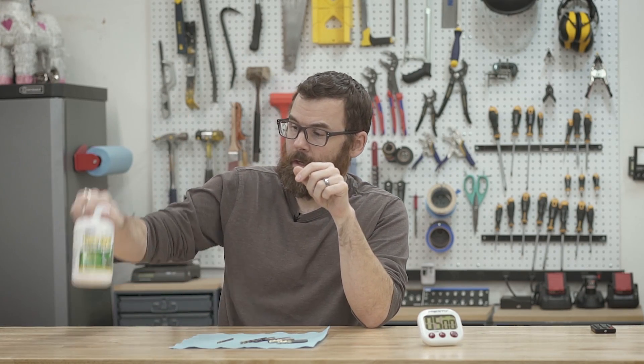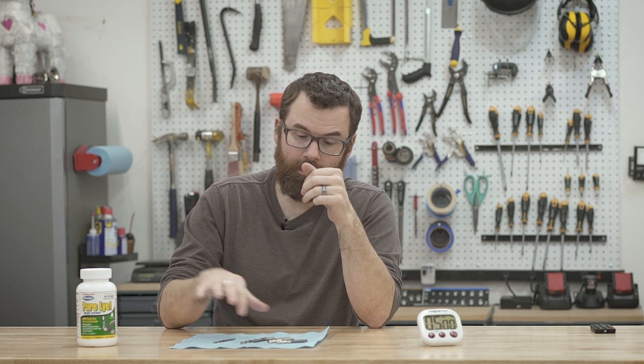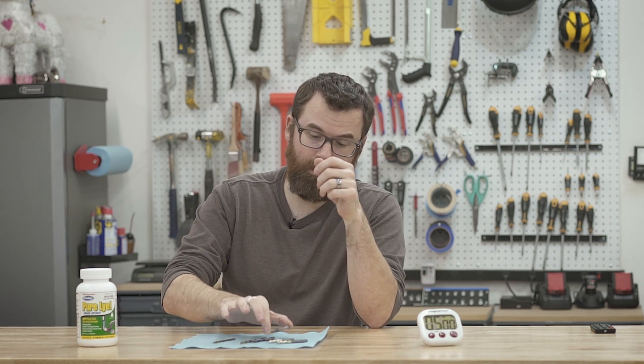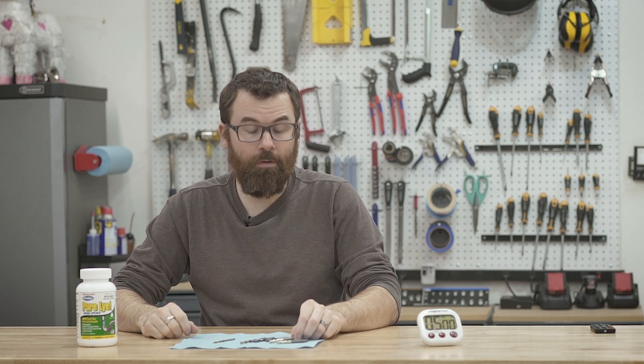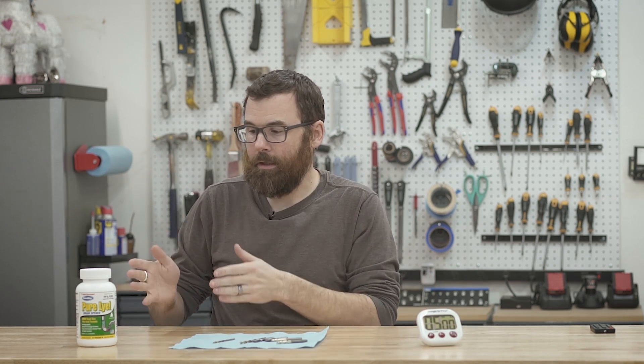Hello everyone. I want to do a quick video today to show you how to use some good old-fashioned lye to clean up your end mills from all that aluminum gunk that gets on them. I'm going to be doing it with some drill bits as well as some end mills. If you've ever done any machining with aluminum, you know it can get clogged into the flutes, and if you do the wrong feeds and speeds you can actually clog them up completely to where the flutes aren't visible. You can weld the aluminum in there and it's a pain to chip it out. So in this video I'm going to show you how to use lye to get rid of that and basically refresh your end mills and make them look practically new. Let's get started.